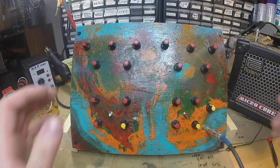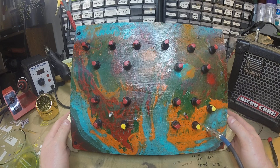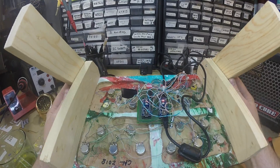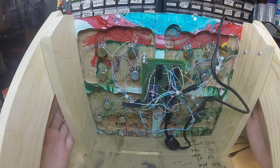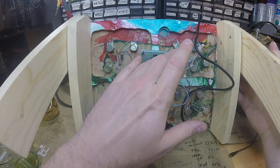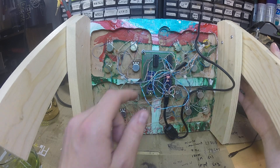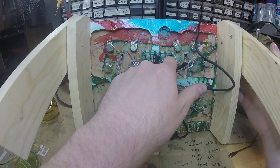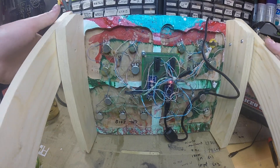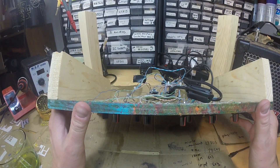So check it out — this is a box I made about three weeks ago. I don't know if you'd call it really a box per se, since it's not really a box. What I've got here is basically a synth controlled by two Arduino nanos, power is bussed from one to the other, and two CD4046s being used as VCOs. One of them has the capacitor here and the other one over here. One's set up more traditional, one's more experimental, and it makes some cool sounds.